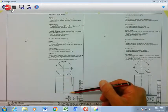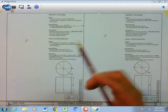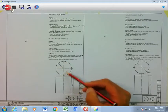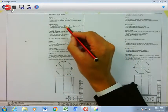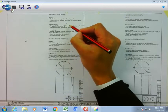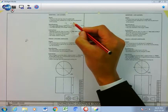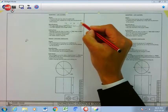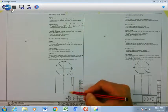And for us to trace this point as it makes its way to the top, we need to have divisions equally spaced apart. And because we are working with a circle, we normally divide the circle into 12 parts, which equates to one full turn. So what I'm saying, learners, is that within the 60, which you're going to have for one turn, there will be 12 spaces. And if you have half a turn as well, then you're going to add another 6 spaces, because 6 is half of 12. And that's going to be altogether 18 spaces within 90 millimeters, which you have here.